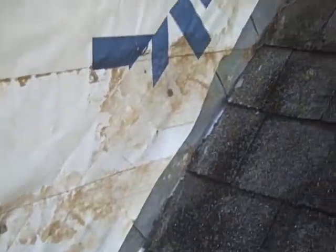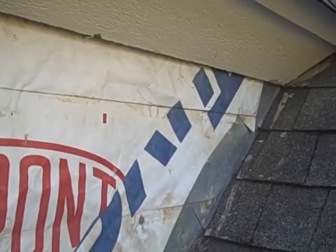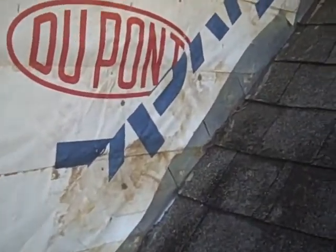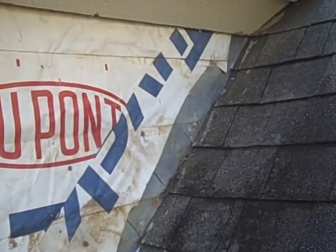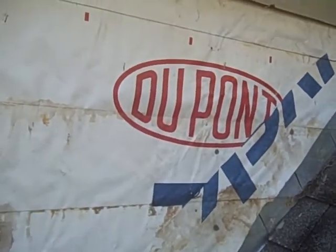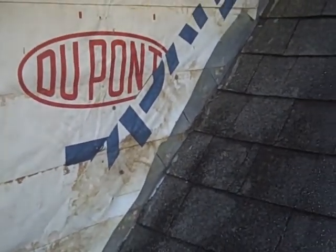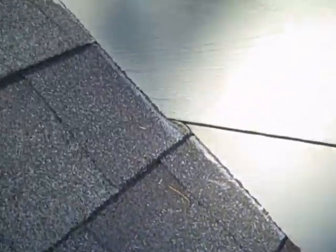Here at the roof line, the siding was literally laying on the roof — you can see the paint lines where it was sitting. You always want to leave your siding off the roof about a half inch so that water doesn't wick up the ends. And when you do put your siding down there, whether it's off the roof a half inch or not, you want to make sure it's painted on the bottom so water won't wick.